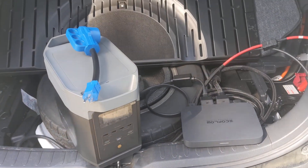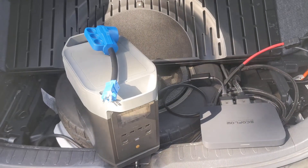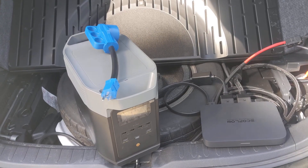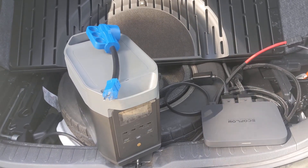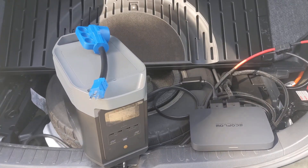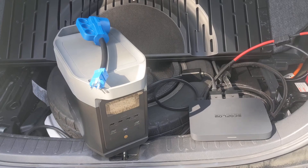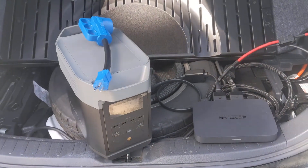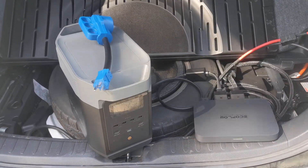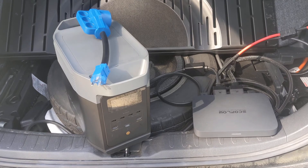Lights, refrigerator, the boiler to keep the house warm — that kind of thing. So as long as your average usage doesn't go beyond the 800 watts that the alternator charger can put out, you can essentially run indefinitely. This particular power station can put out 1,800 watts continuous, so with occasional surges from cooking, turning the heat on, or running hot water, the EcoFlow Delta II or whatever power station evens out those bursts, while the alternator charger just provides the constant rate of recharge — and essentially you'd never run out of power.